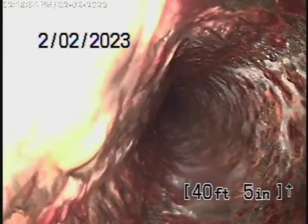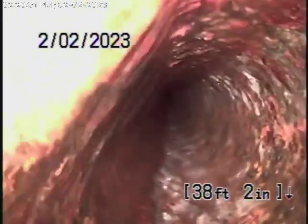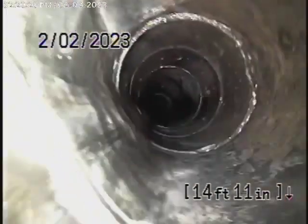We're running our camera from the two-inch roof vent for this little unit at the back. It ties into the main line with the pool house cast-iron pipe — you can see it's obviously getting a little old, but it still appears to be in pretty fair condition with minor rust buildup. As for those possible cracks, it's very difficult to say whether it really is cracked or not, because cast-iron pipe develops rust and sometimes gets discolored. Those cracks didn't show any roots or anything getting into it, so that's good. It then comes underneath the little unit with ABS plastic and comes up the roof vent — all very clear. On the whole, everything looks pretty good.